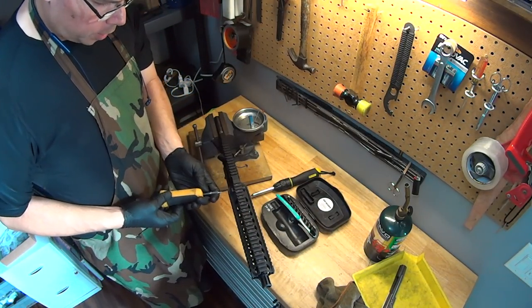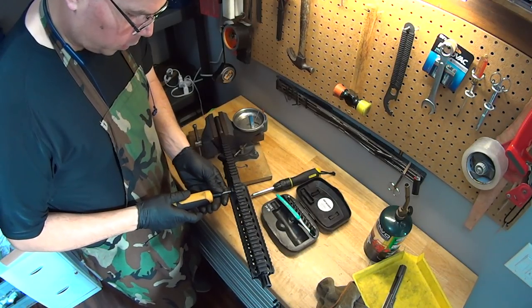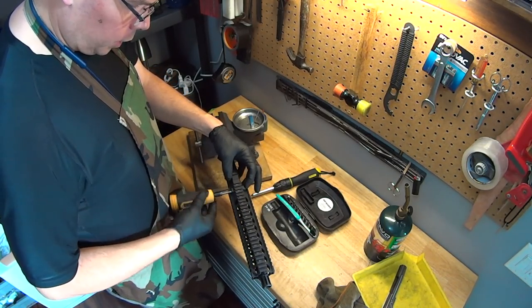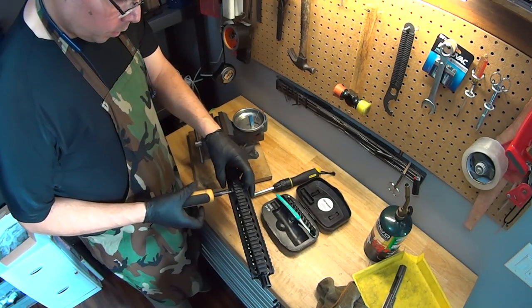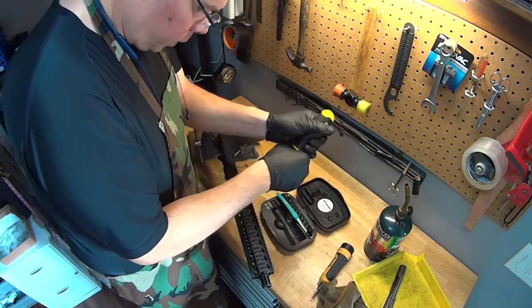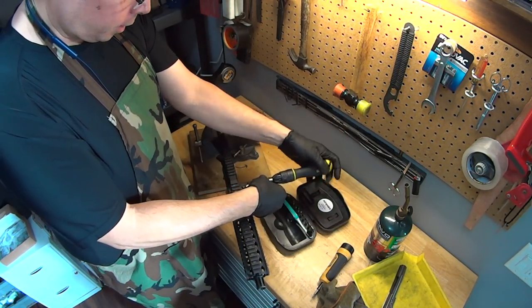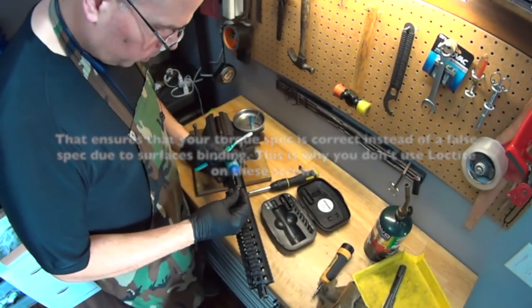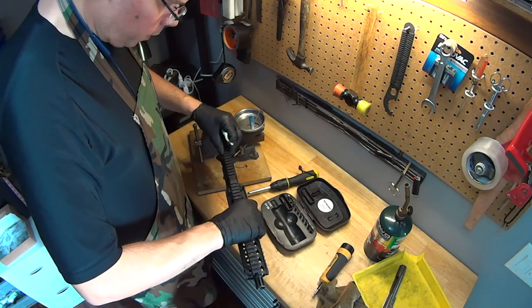When you're doing this, guys, make sure you're supporting the tool, or, well, when this gets introduced, you have to support it. Once that's locked in, push on the other side, push this against your belly and rotate. You want to make sure that there is enough oil on every surface so that everything is sliding off of everything else. Because lubrication makes assembly so much easier.